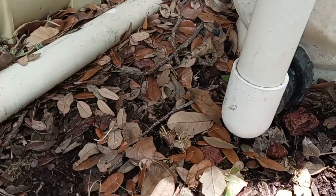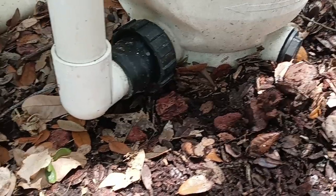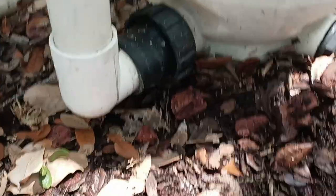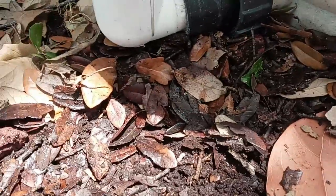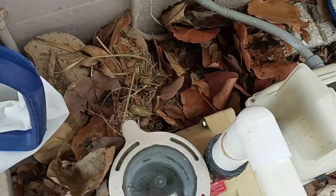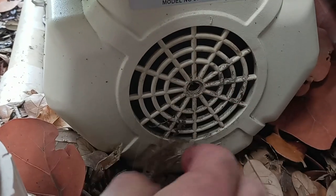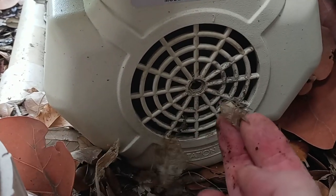And this is a perfect example of what not to do. We can see the amount of debris around the motor and on the equipment pad — I removed a lot of it. This was a recent pool inspection I did for a customer. It was all under the plumbing and unions, which is bad due to the fact that leaks are more difficult to find. There was a lot of debris next to the pump motor and pump pot, and I wanted to show you this area of the motor — the air intake. I found a small leaf to demonstrate the amount of air that the motor needs to stay cool.